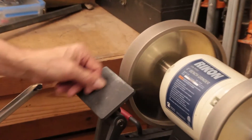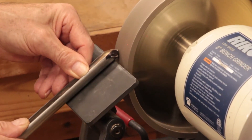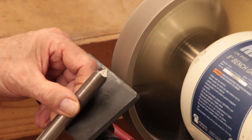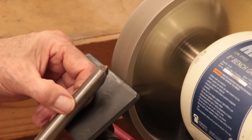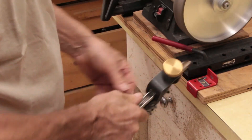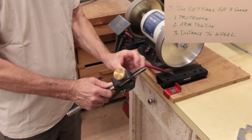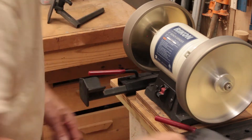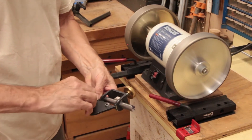I've got a straight line on here I can use to guide me, and I'm just going to bring this in and grind it back. So I've ground it back — now I've got a 40-degree angle, maybe gone just a touch more than I need to, but that's okay. We now have our bevel set on there. We'll use that to set our distance to the wheel, and we'll set our distance in the Vari-Grind. Remember, the three position settings are: protrusion from the end of the gouge to the face of the jig, setting the arm, and setting the distance for the V-arm. As an experiment, we're going to move this up to the second notch, which is probably where we need to be for a 40-degree setup.